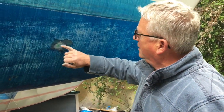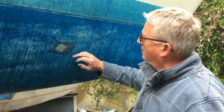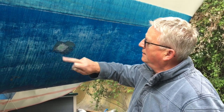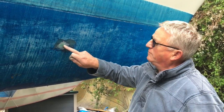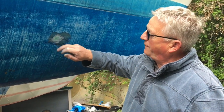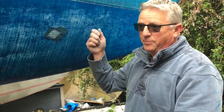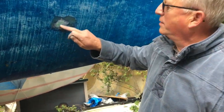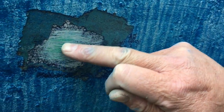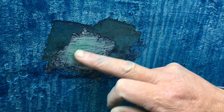I've scraped back an area here so you can see a fairly loose antifoul product at the top, which is an incompatible product to the one underneath it. And underneath that coating, if you look really close, you can now see a grey and a green. It's where the epoxy manufacturers have used two different colours so that when they've applied it, they can tell where they've been. When you scrape back gently or use a little bit of wet and dry and you start seeing green coming through the grey, you know you've got an epoxy coating underneath.